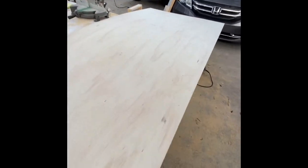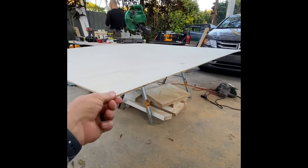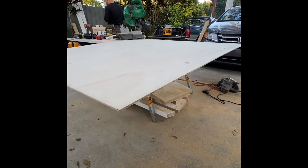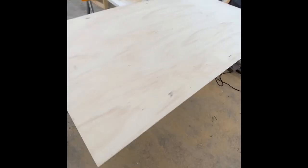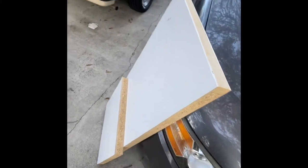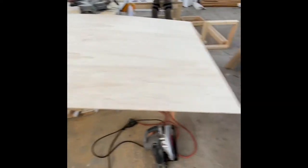Just like the doors, I'm going to take this little itsy-bitsy plywood — that's got to be an eighth of an inch, it's just thin. That's going to be the back of our bench. It'll keep everything nice and light but still contain everything, and nobody will see it. I'm going to mill out our two back panels — I measured at 20, and then we'll cut it at 45 so we can get both backs out of this one strip. We used the same approach with the doors — just a simple skill saw — and you can do a lot with scrap wood as long as it's big enough.